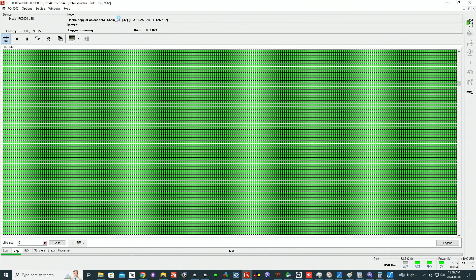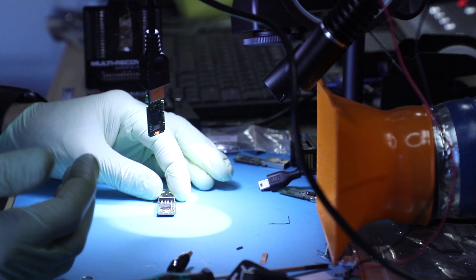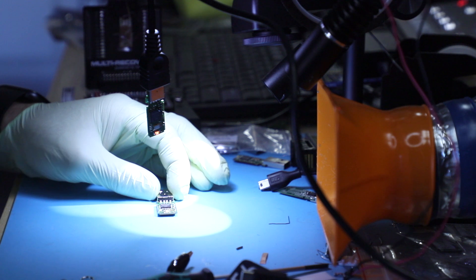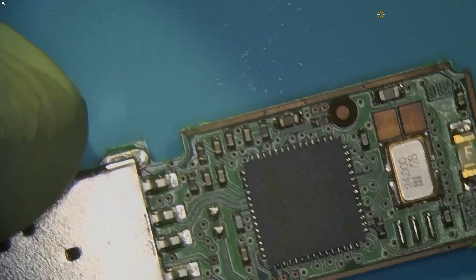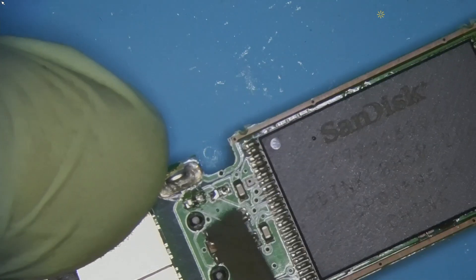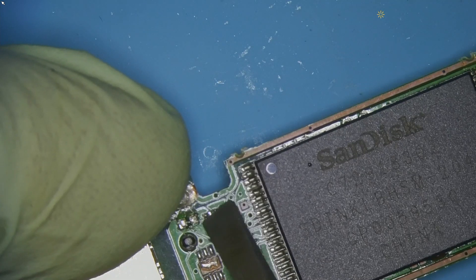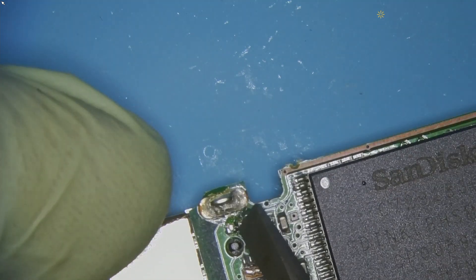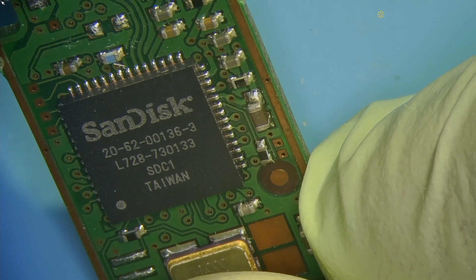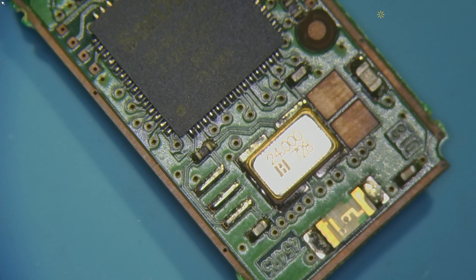Sometimes due to a failed capacitor the whole device stops operating. What was deceiving about this one is when I first plugged it in during testing it was consuming nothing — if a device is consuming nothing it doesn't give many clues. This device had somewhat primitive power surge protection: a fuse located right here that burnt out when this line got hot, because of this capacitor. It blew up the resistor here, cutting everything from the controller — 2062-00136-3. Component level failure solved. If you need this service, link in the description. Thank you for watching.